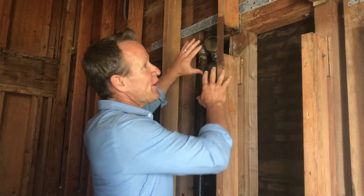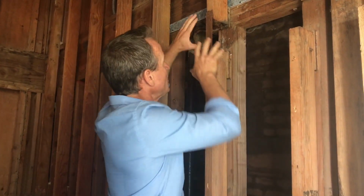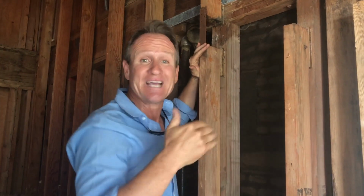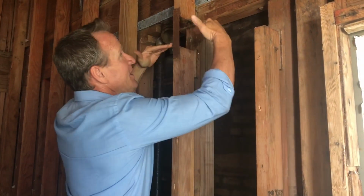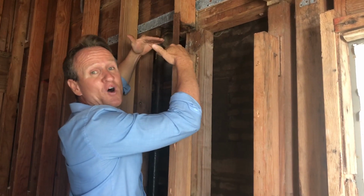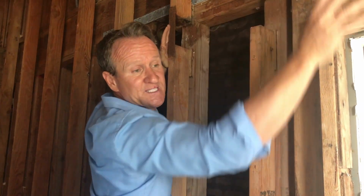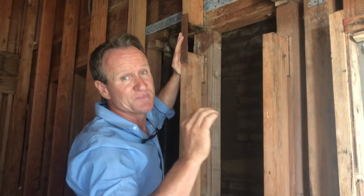So one thing to consider is always start from where the water's flowing to. So you start here and work your way to where you're going to connect downstream. And the reason why, if you work the other way, you may end up too high over here, not able to make that connection, giving you proper fall. So again, always start with where the flow is and make your connection downstream. So that's one very important tip to consider.